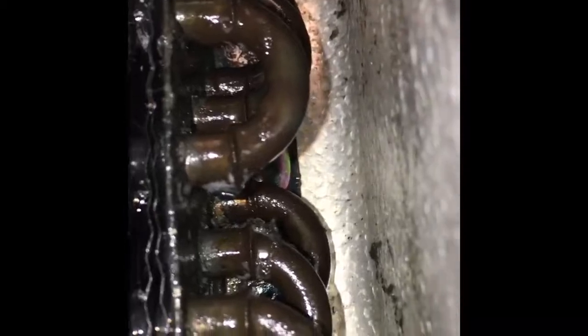This is the far left end of the far left evaporator coil. Put my sniffer down here — that's where it's at, that's where the leak's at. I don't know if you can see the bubble but I can see it. It's way back inside, all the way at the wall.